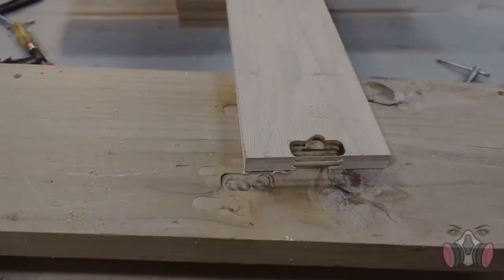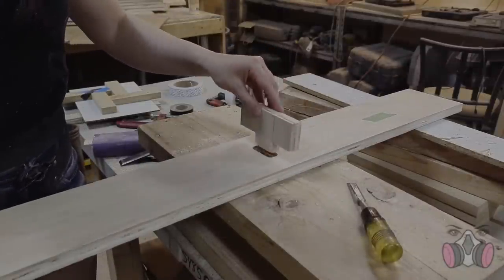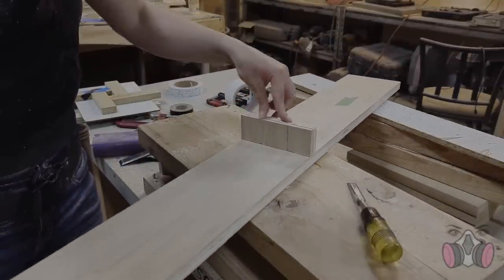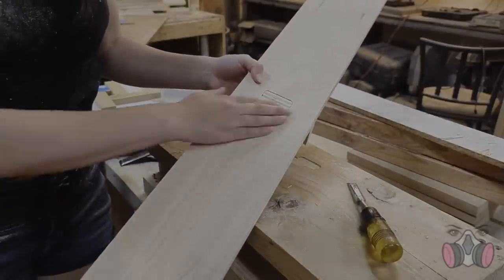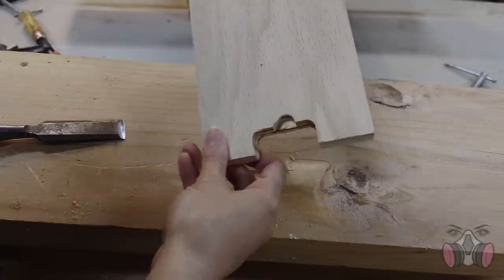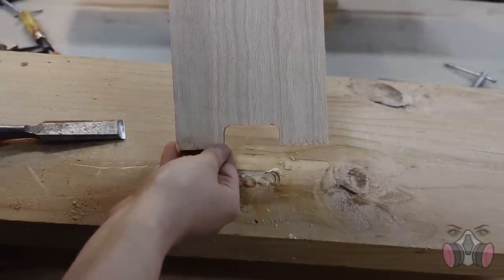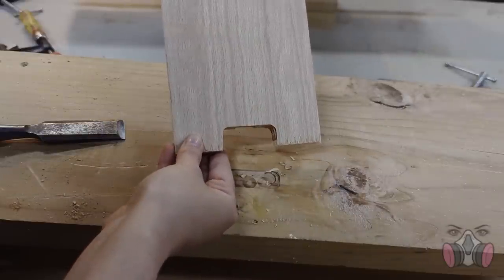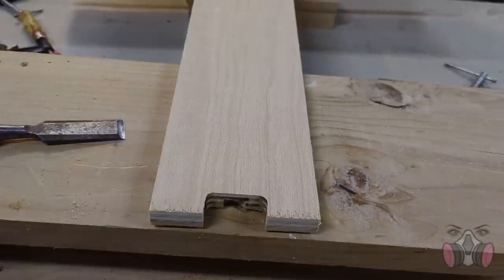Aside from the template screw-up, everything else went well. I know this end cut looks weird, but that's because the end leg joints and the middle leg joints need to be slightly different — I'll cut off these thin parts on the bandsaw and it'll look much better. I finished up the first bottom slab and made sure that the tenon sample fit in well, so it was in the exact center and flush with the top. When I cut the bottom parts, I took care of the ends on the bandsaw. I made them this way because I want the outside edge legs to be flush with the bottom piece. So for the outside legs, the outside edge of the mortise is going to be square and the inside curved. And then for the middle legs, the entire mortise is going to be curved. This is an aesthetic choice, not a structural one — I just think it's going to give it a way nicer look.